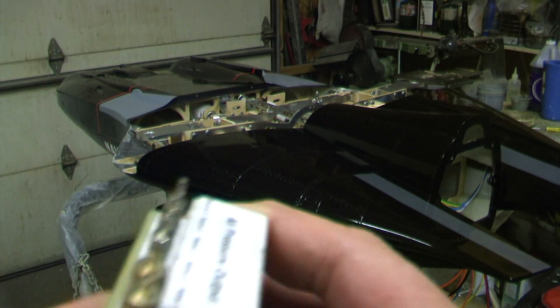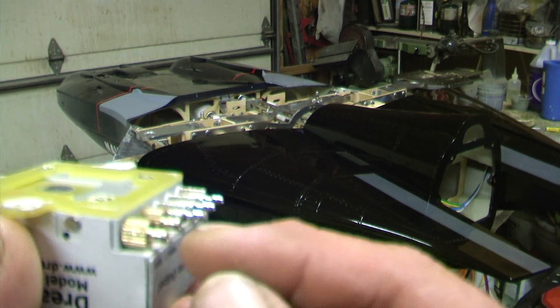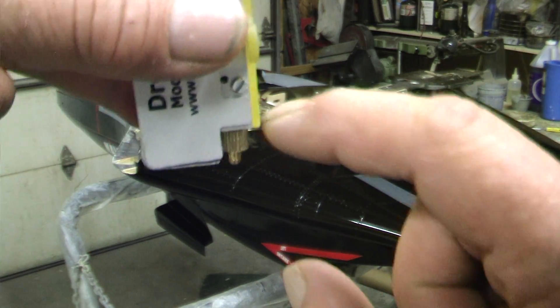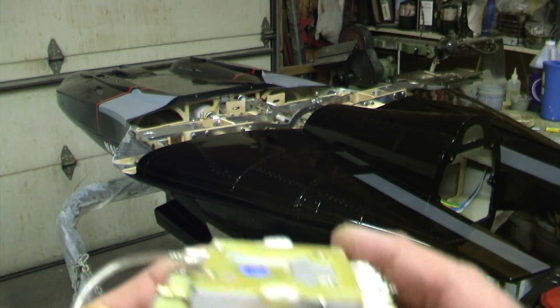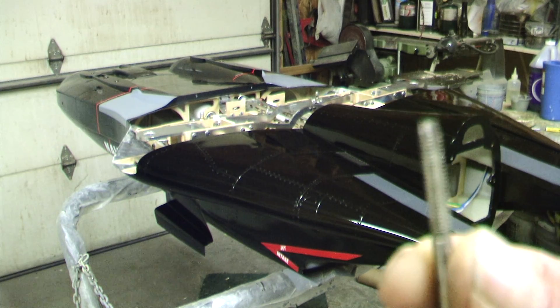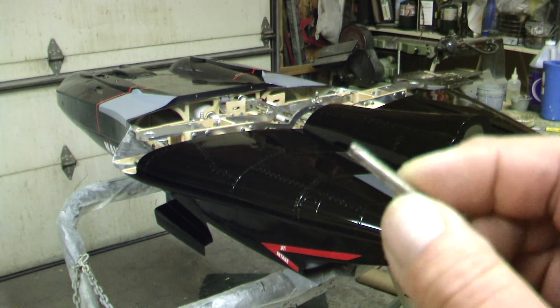What I did is I took one of my brand new cobalt bits and drilled it from the bottom, just letting it spit out one long shaving of aluminum so I didn't get anything inside like from a dull bit. Then I tapped it. I actually had to grind the bottom off my tap to make it a bottom tap. You can buy them - they're called bottom taps - but all they are is taps with the end ground off just a little bit.